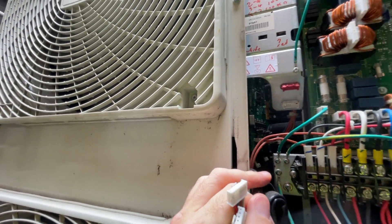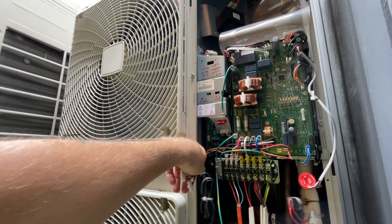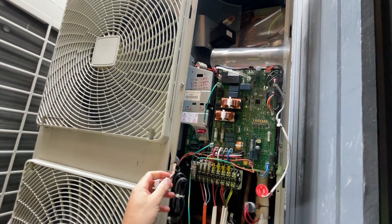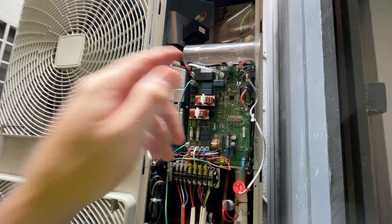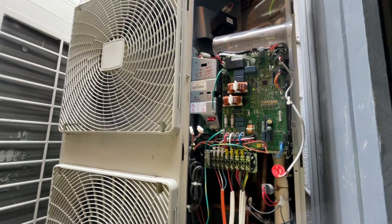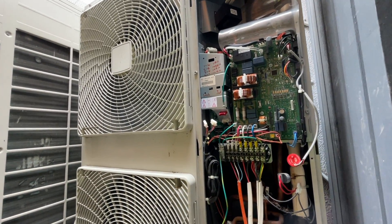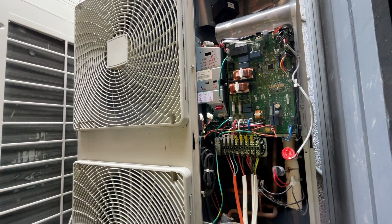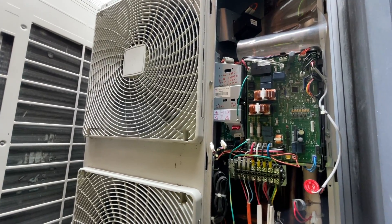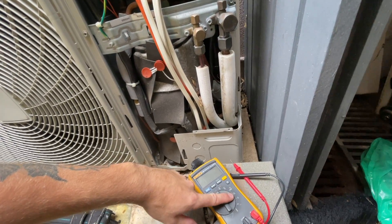It's not hard to diagnose if you have the information. I recommend getting the Daikin app and always having it with you. For this particular job, I didn't need to plug in the Daikin diagnostic tool — it's just a basic fault. The fans stopped working, so it came up with the E7 fault. The board is just not pumping out the right voltage. You definitely need a decent multimeter where you can change the range.